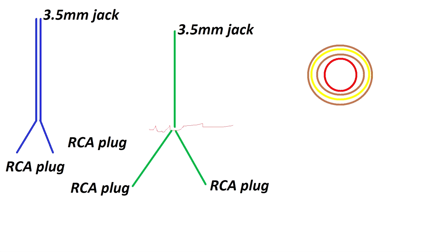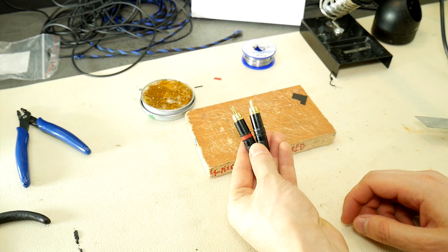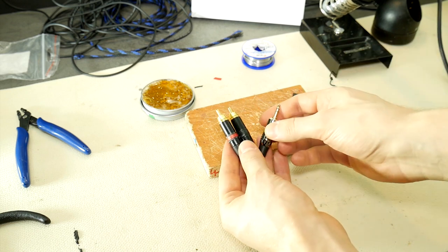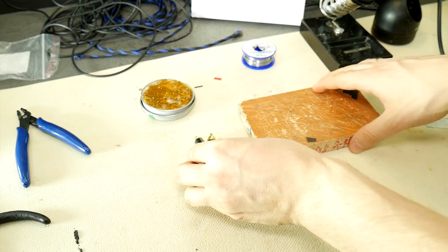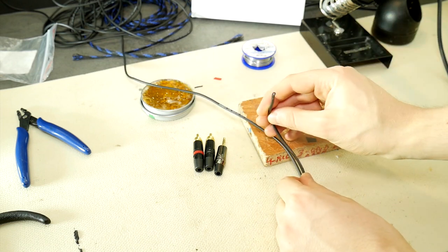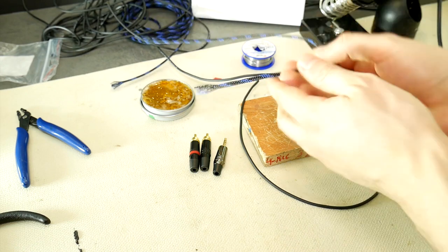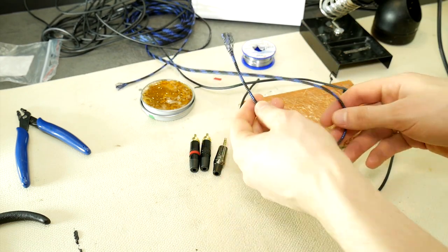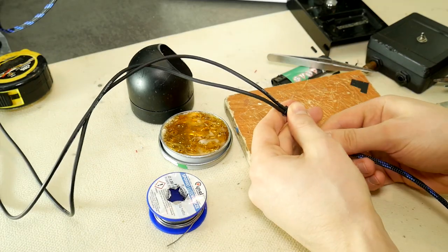This is the end of the physics lesson — now let's apply our knowledge. To create a high-quality auxiliary cable, you will need to buy two RCA connectors, a 3.5mm stereo jack, and a shielded audio cable with at least one conductor. I will use Tasker C202 balanced microphone cable — an Italian manufacturer offering good cables at an affordable price. This cable is flexible and soft, which are exactly the properties required. You will also need braided cable sleeving to put the two cables in, creating a single cable.